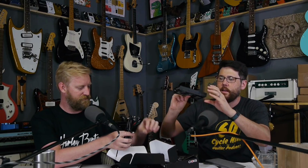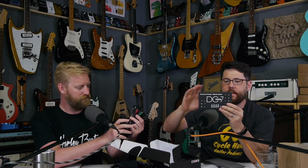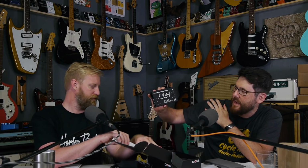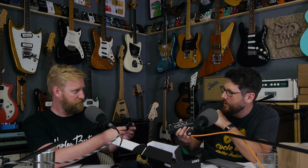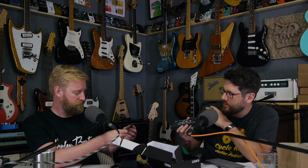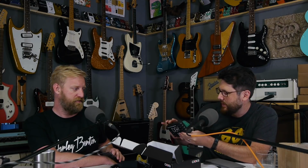This is super cool. It's an ultra thin, high power supply. Basically, you can see on the front, you've got 9, 12, 15, and 18 volt settings for every output. And at 9 volts, it does 660 milliamps, which is plenty. I think for isolated output, 660 milliamps is close to, if not, the highest single output I've seen for a fully isolated one. Obviously, if you have a non-isolated one, they just dogpile. There are just a ton of features on this.